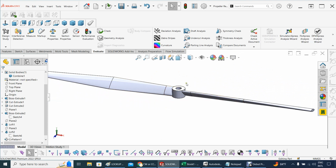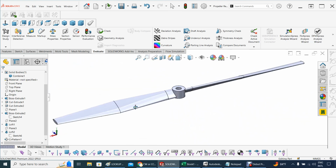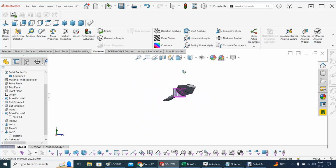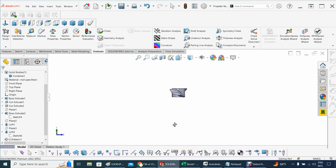Now, there's a way around that. If you use a lock nut, then it shouldn't be a problem. Let's say you're using a clockwise type of nut or clockwise motor, it has nothing to do with the direction of the propeller. Remember, there's no such thing as a brushless motor spinning only one direction, clockwise or counterclockwise. A motor will spin according to whatever you set on the speed controller. So by jumping the cables, you can turn counterclockwise or clockwise. But now this propeller, the way it mounts on the motor, needs to turn clockwise.